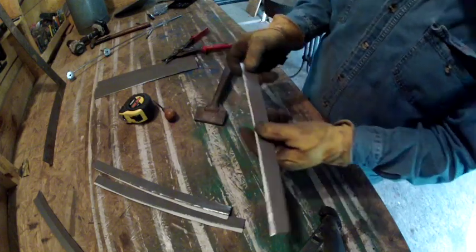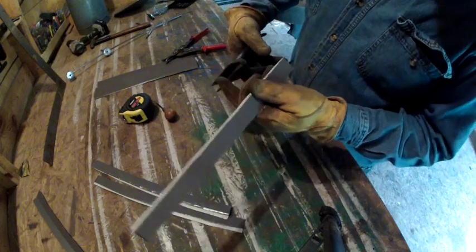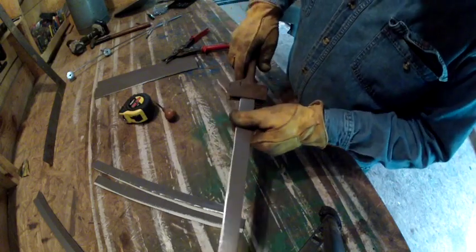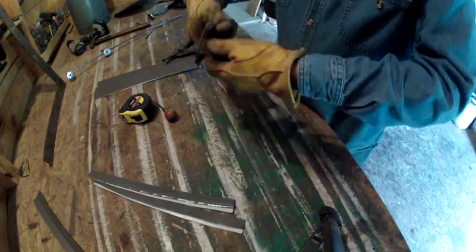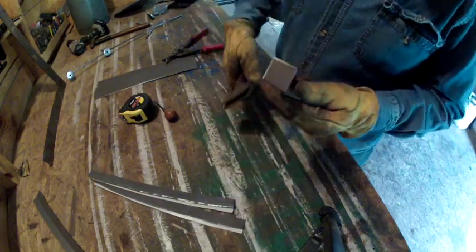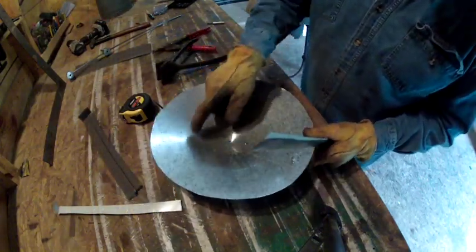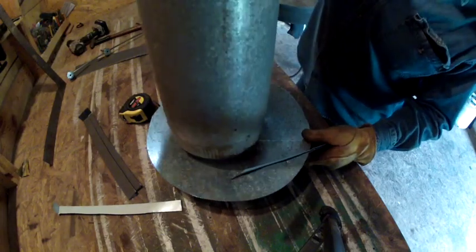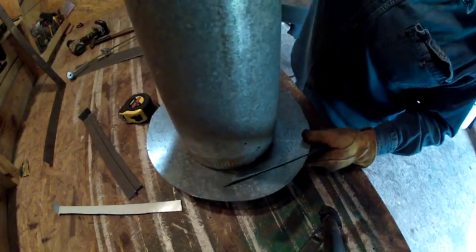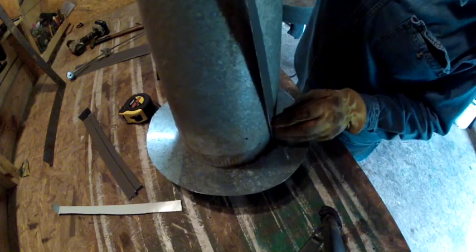Now the next thing you do is you want to turn an inch down on them things. So these are an inch deep. So we'll just turn them down on a 90. Just like that right there. Now guys, remember that circle right there? That's what we're looking for right there, okay? So you want this to line straight up with this.